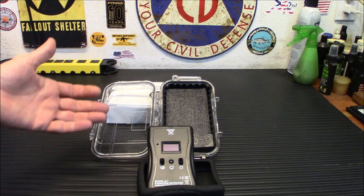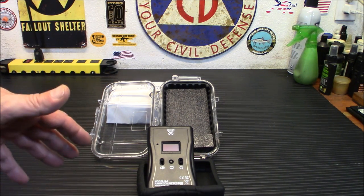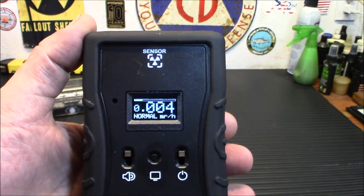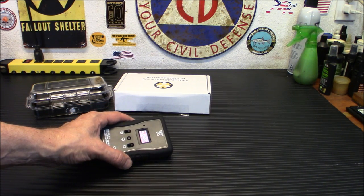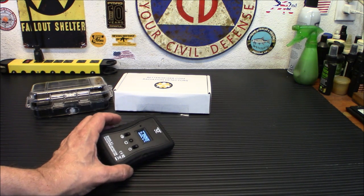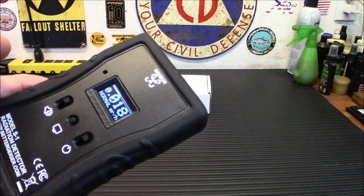Let me move everything out of the way and put the check source on the table. You can handle the check source — you can touch it; you're not going to immediately die of radiation poisoning. It's a good idea to keep it somewhere it's not going to be constantly interacting with you — maybe stick it in a safe. It's the lowest possible dose to give a reaction to a Geiger counter. They run about $45 for the check source and there are some restrictions — it's only shipped inside the United States. Now you can see our levels — that's normal for our area. I'm going to move the source closer. You can hear it reacting, and as I move it away the ticking slows down.